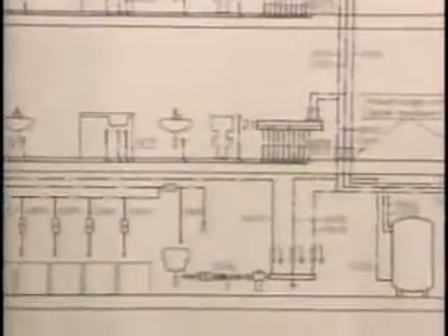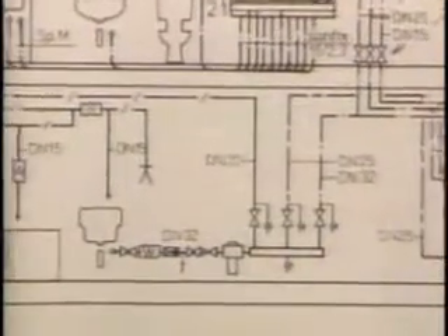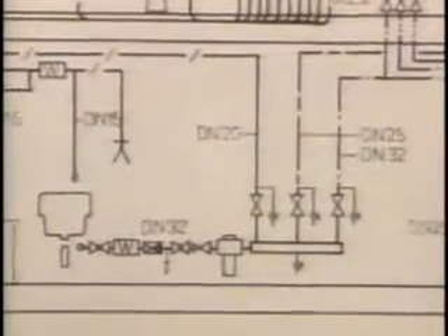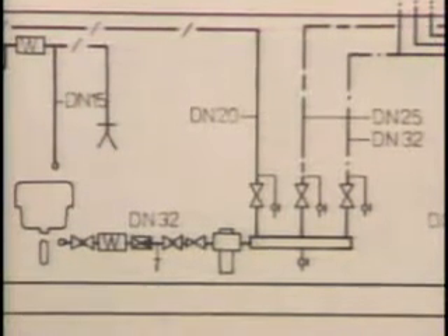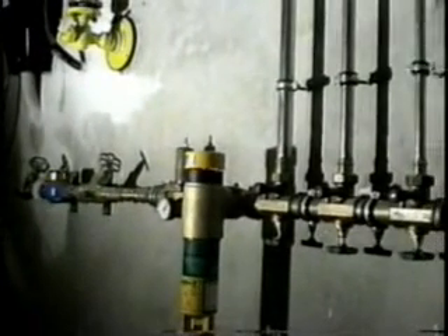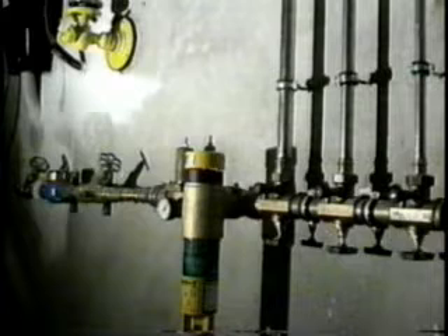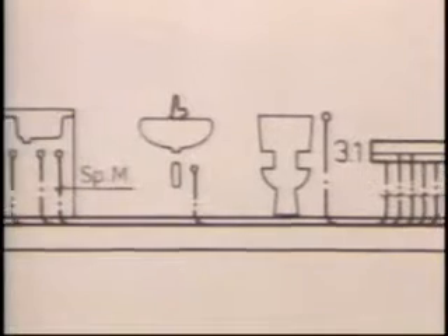First, let's look at the hot and cold water distribution. In this case, the eight-port PEX-A pipe secondary distribution manifold is fed from a three-port primary manifold. The supply starts at the water meter of each apartment, and the drinking water installation begins at the primary distribution manifold at the main supply point to the house.